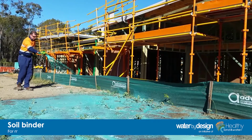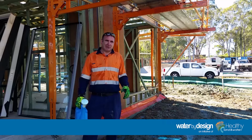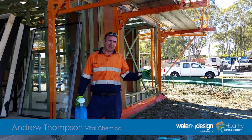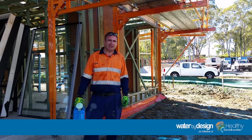So once we've backfilled around the slab, we're trialling a new soil binder. What we've done is we've used a product called Vital Bond Mat Stonewall, and we've used it at a 10% concentration. So that's one part product to nine parts water, and we've used roughly about 200 litres around 200 square metres for this house lot.